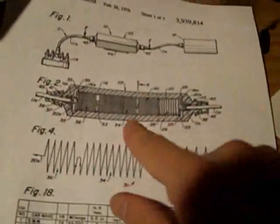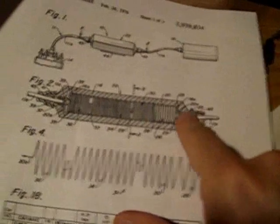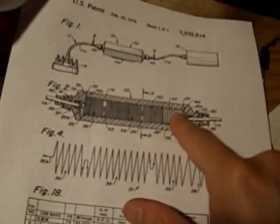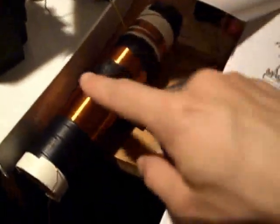This page is a breakdown of it. Basically, it's one single wire wound over an electrically inert core — which means use plastic, solid or hollow, it doesn't matter. Don't use wood, as he says, because that could retain moisture. You're not looking for a magnetic field in an iron core or anything like that. What you want is something like plastic.